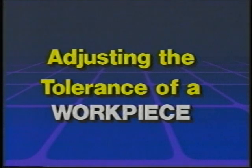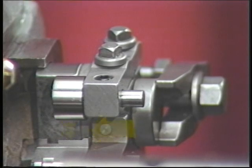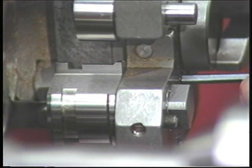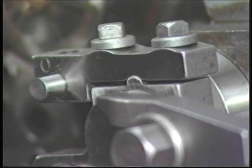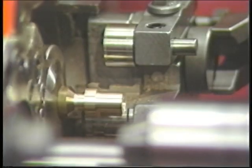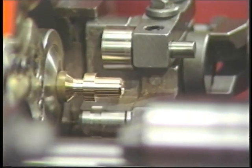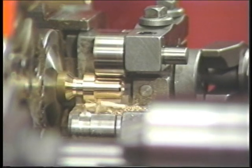Adjusting the tolerance of the workpiece. The distance between the size tool and the size tool roll is controlled by the roll holder. The size tool roll is located in the roll holder and the size tool is located opposite the size tool roll in the cutter shank holder. The roll holder is connected to the holder body by two adjusting screws with a pivot point at an equal distance from each of the screws. After making a workpiece, if its diameter is not in tolerance, move the size tool roll closer to or away from the tool depending on whether the workpiece is to be made larger or smaller.